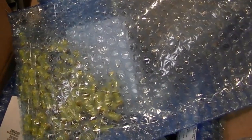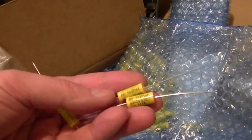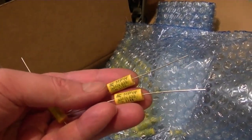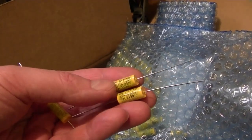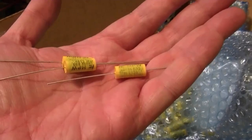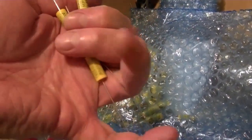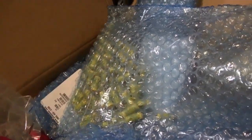Here is another option: Illinois Capacitor. Just a coincidence — they're based out of Chicago, like myself. Allied Electronics carries them. I was surprised to see that 0.047 microfarad, 630 volt, metallized polypropylene — really nice caps — only 38 cents each, at least in large quantities. So I ended up getting 100 of them because I go through a lot of these. But even at quantities of 25, not a whole lot more.